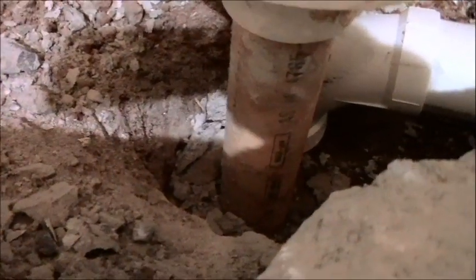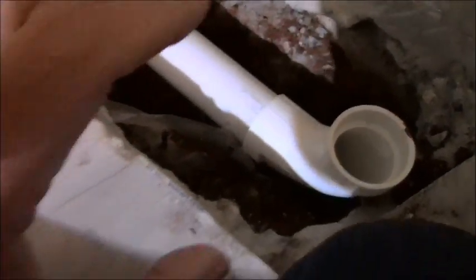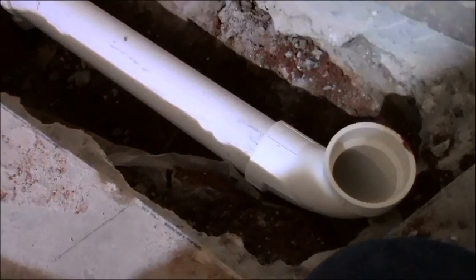Definitely leaning over to the side. So yeah, I'm going to go forward with gluing this part in, get my drain dry fitted, make sure that it's exactly where I want it with my line, make sure it's exactly the rise that I want it. In this case there will be no rise, it'll be flush. The bottom flange will be flush to the top of the finished floor.